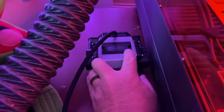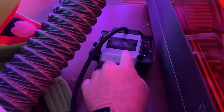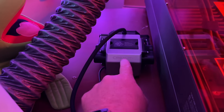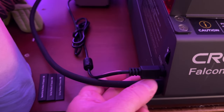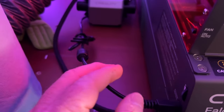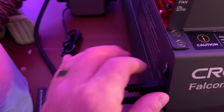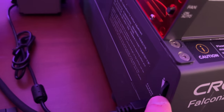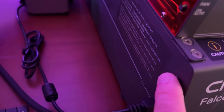Here is the small compressor that acts as your air assist. Whenever you do cutting and engraving, it's very important to have this connected, because it will prevent fires and other things from occurring and prevent overburning. This is the power supply going to the air, and you can adjust how much air you want to go in, or cut it off completely. You can also do all this from your software.